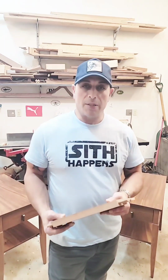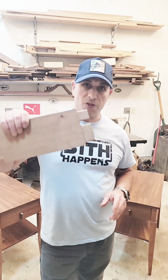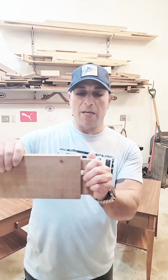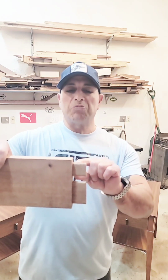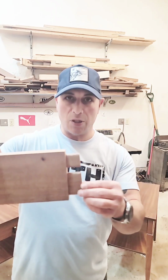And the pieces, for the most part, feature traditional joinery. In this case, it features a double tenon. This is a double integral tenon, meaning these are part of the piece. They're not what's called floating, and that means mortises would be cut in here, and these would be individual pieces stuck in here and glued in here.